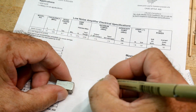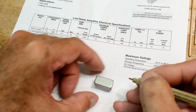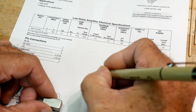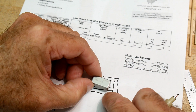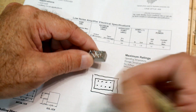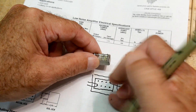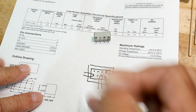What I'd like to do is have a board with eight vias and a ground plane around it, so when the part goes down to the board the case is pulled against it and everything looks like ground — interdigitated ground. Then we'll have an IN trace and an OUT trace, and a trace for plus power.